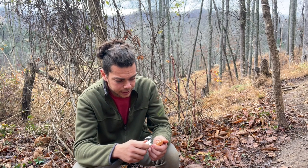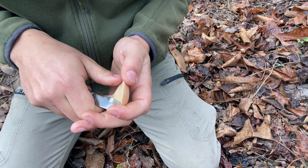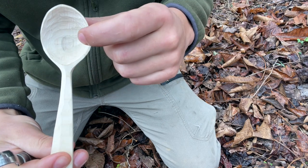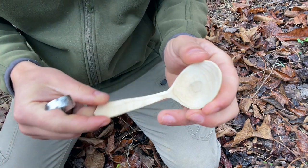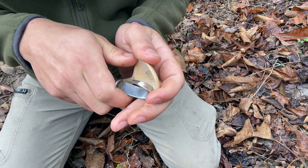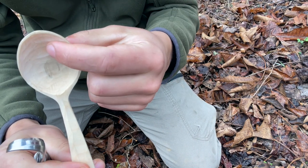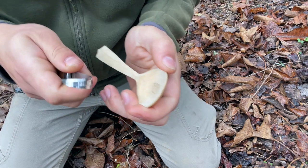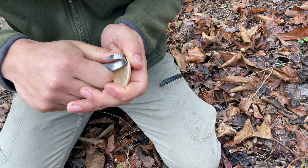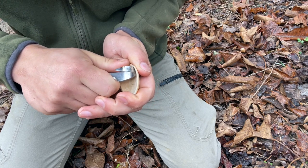The first thing I'm going to do is clean up the inside of this bowl — get rid of any of these hairy bits in here. It almost looks like it was skipping across the wood right here. So I'm going to just try to take the thinnest layer possible from edge to edge. You can see how that one cut is different than the rest. All I'm doing is clearing away any of that oxidized wood, smoothing it out, and getting rid of those skip marks.